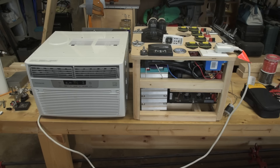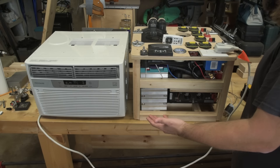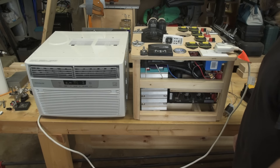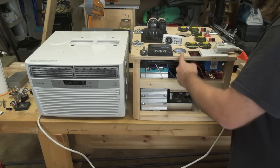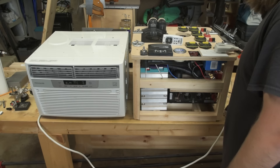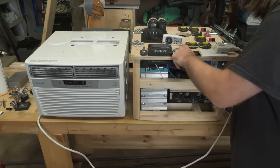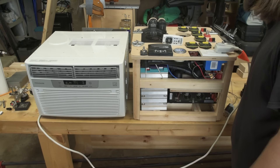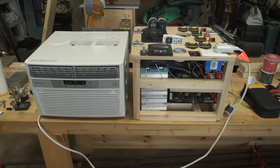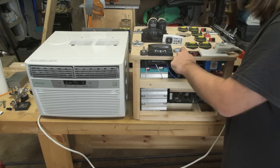It's kind of interesting seeing an air conditioner run off of a solar generator. If you had around 600 to 700 watts of solar input — probably 800 watts of panels or a little more — you could effectively run this air conditioner indefinitely during the day. This is all being driven off of the Xantrex SW2000 inverter. My runtime according to the Victron for this unit on battery power is about half an hour at roughly 70% charge — it might even cut out a little before that. We're at 586 watts and pulling 45.7 amps from the system.